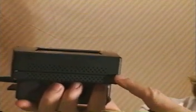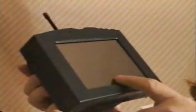The Star 7, in its guts, is a SPARCstation motherboard. The screen is from a Sharp LCD color television. There's a 900 MHz spread-spectrum, 200 kilobits radio. There's a couple of PCMCIA card slots. There's an infrared transceiver for talking to TVs and VCRs and that sort of stuff. A couple of speakers off of a Nintendo Game Boy.